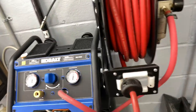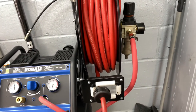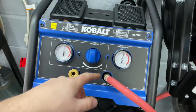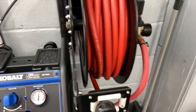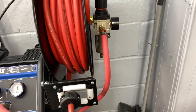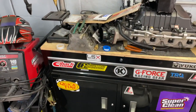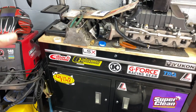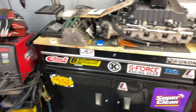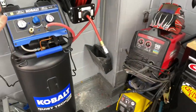Overall there's really no restrictions here. It's a 50-foot hose, which I don't think is going to make too big of a difference, because all the fittings going through here everything's direct — it isn't using a quick connect that's going to cause a restriction. The only thing I can really probably do is go to a bigger inside diameter hose. This is a 3/8 — maybe if I go to a half inch it might help with the blaster. I've got to see once I actually get the cabinet and start trying it out. But I think I'm going to get a workbench, or take one from my house — one of the six-foot ones with storage underneath. Maybe I'll remove the shelf and put the other compressor underneath, use it as an extra tank. But I have a feeling that the 26 gallons is going to be plenty.